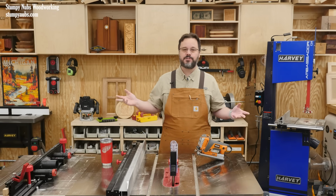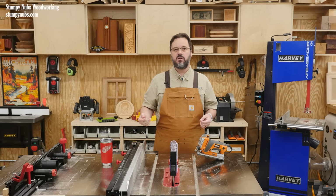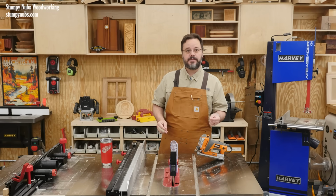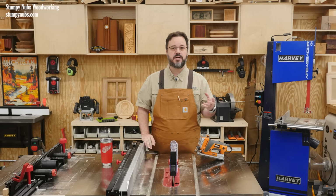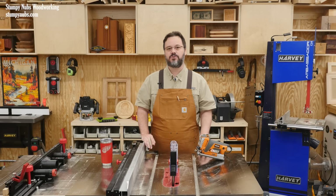Bimetal blades are perhaps the most common nowadays. They combine the flexibility of high carbon steel with the durability of high speed steel. You can also buy carbide tip blades for cutting through nails and other tough jobs, or abrasive blades coated with carbide chips or diamond dust to cut tile and glass, brick, concrete, that sort of thing.